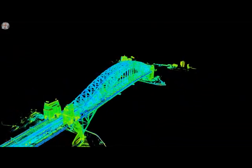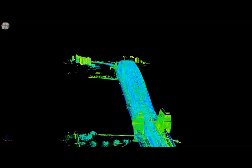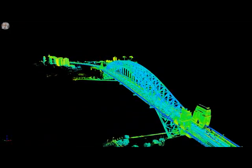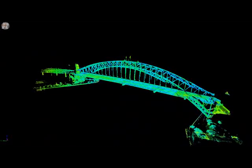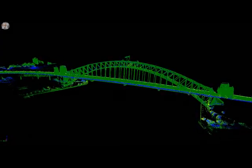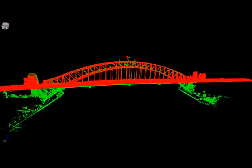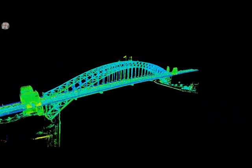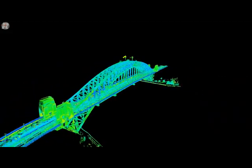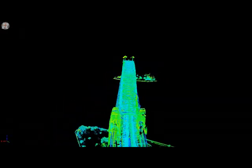Now that we've finished the survey from the boat, we need to combine the two sets of data. In the background we've had a base station running within three kilometers. We have now post-processed this data to combine the ship-borne data with the data taken from the vehicle driving across the top of the harbour bridge. In the next animation, you will see a combination of the two data sets into one complete seamless data set of laser points, all accurate to within 20 millimeters true position.